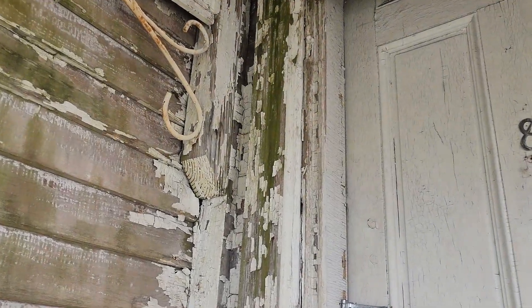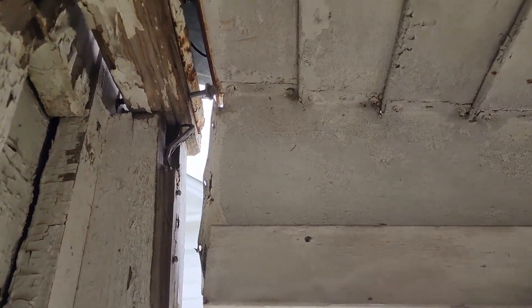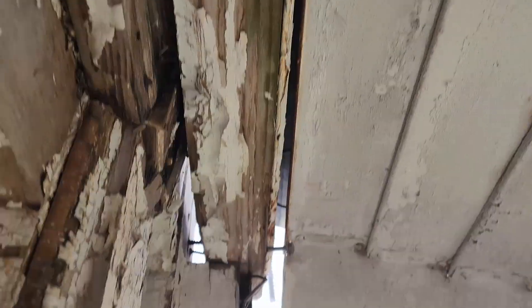Some places you can kind of chip away, but it's going to be a lot harder to scrape this off up here. So that's where it goes back to saying this is not going to be pretty — areas like the front of the porch are going to be a nightmare to scrape, and I'm not going to be able to get everything. My plan is to scrape off everything I can, and what I can't, either feather it out with a grinder and a flap disc, or depending on what it looks like, just go straight over it. It won't look perfect, but it'll certainly look a lot better than it does. This porch is barely hanging on by not many threads.